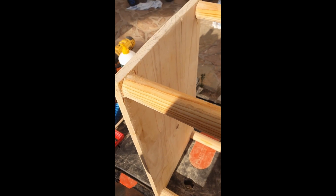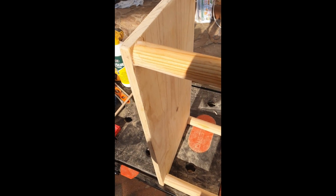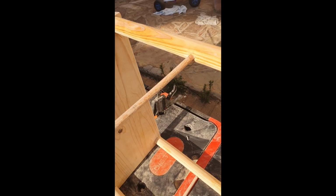You see, whenever you're sanding, the dust itself from the sanding goes into all the little holes, and by wetting it you'll be able to see exactly, it'll pull out the dust basically, and you can see exactly what you need to still fill and what you need to fix. Like this here, anytime you have repurposed wood, you're going to have blemishes in the wood, you're going to have cracks and things like that, and there's ways to fix that, which I'll show you just now. But sanding it and then wetting a cloth and wiping it down will pick up all the dust and will allow you to see whatever imperfections you still got to sand down or fill in.